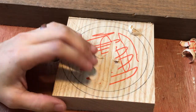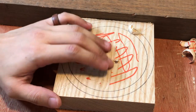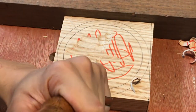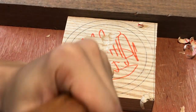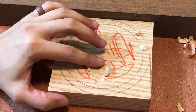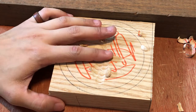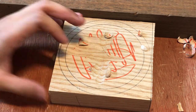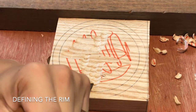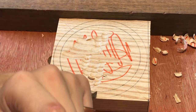I'm reading the grain. With this piece of ash you can see very clearly that it's running straight grain. So by working along the grain I'm going to get quite easy peels of material out. I'm going to flip it and work across the grain. I'm still not encountering too much tearout because at this point, since the surface is so flat, I am mostly working across or along the grain. We haven't engaged the slope of the grain yet, so then we'll start laying down the rim. What I mean by that is making a cut along the entire circumference of this inner circle without losing that line, which will help ensure that we have a pretty neat circle by the end.